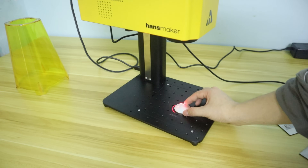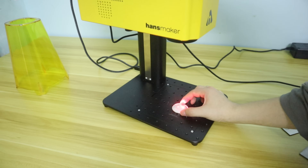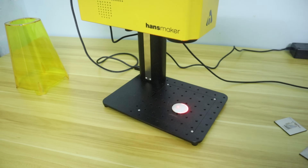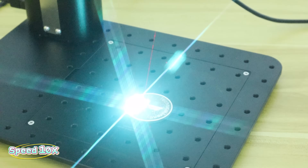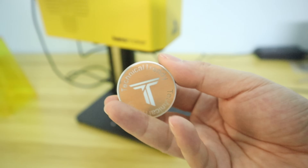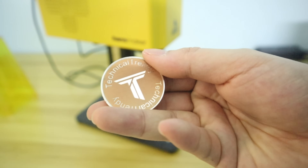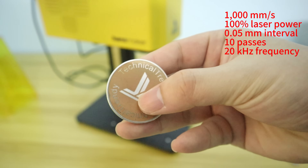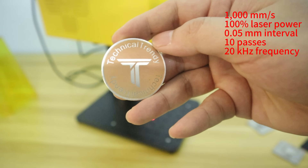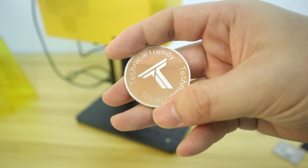Compared to diode laser engravers, fiber laser engravers can engrave all kinds of metals, and the Handsmaker F1 Pro 20W is a good choice for marking all kinds of metals. I did a negative engraving on an aluminum coin, and the engraved surface is very smooth and fine with the fiber laser treatment. The logo and channel name are etched very finely. I achieved these laser markings by setting parameters: 1,000 mm per second speed, 100% laser power, 0.05 mm interval, 10 passes. It took 3 minutes to finish 10-pass engraving, which is fast.